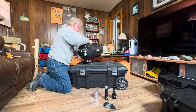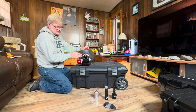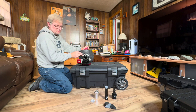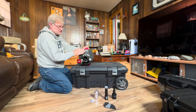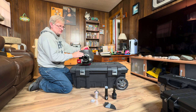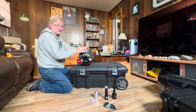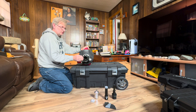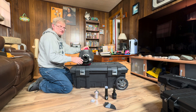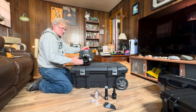On the back end of the telescope by the focuser there are grub screws and collimation screws. Being an 8-inch scope, the focuser is physically linked to the primary mirror, so any adjustments to the focuser are also applied to the primary mirror at the same time. I don't currently own a collimation plate that would allow you to collimate the focuser separately from the primary.